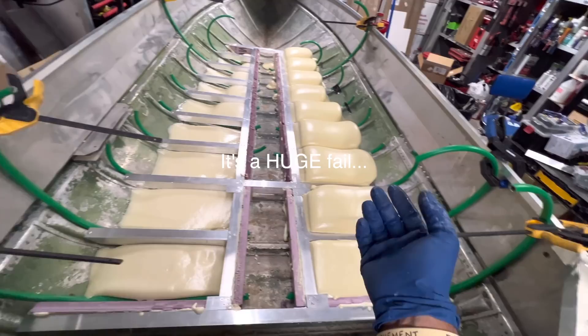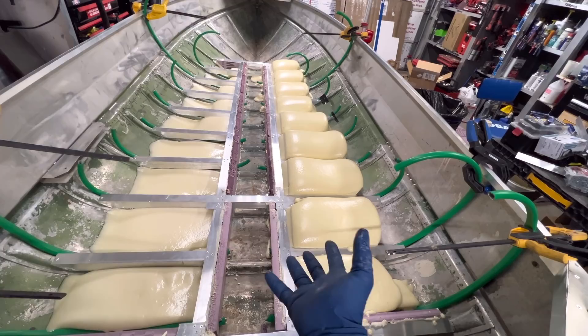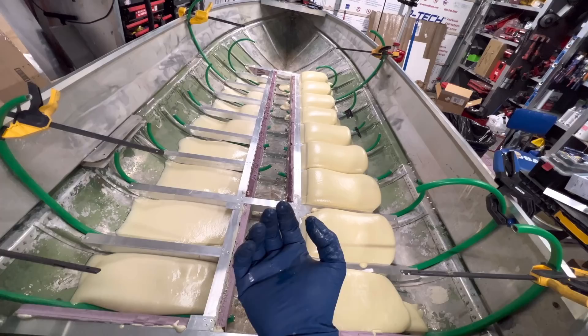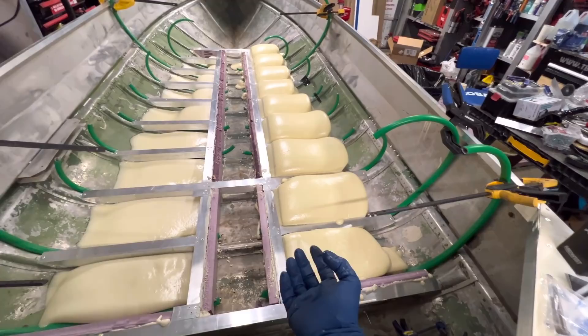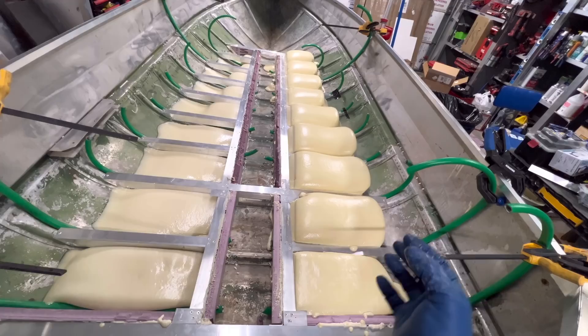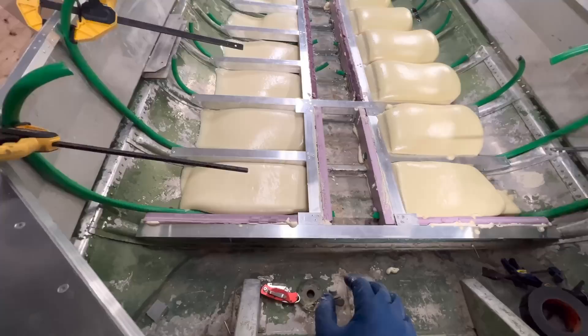What we have here is an overpour but this is actually full two-pound density. So we always get questions - oh, six-pound density or ten-pound density good? No. The whole thing about foam and why it's so good - obviously the fact that it adds structure - is its density. You want the lightest density per mass possible so that when water comes and tries to saturate and sink your boat, you have all this resistance. Same thing when we pour the subfloor - it's all about density, whether or not something will be able to float or sink. You want the lightest density foam to keep your boat lighter and because its mass per volume will resist water sinking.